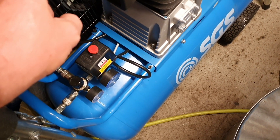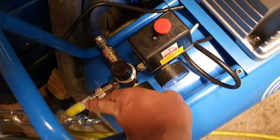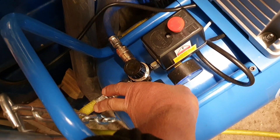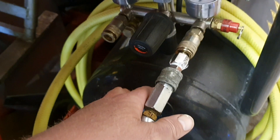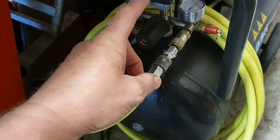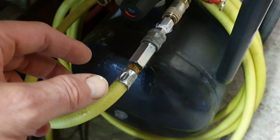I've got a 50-foot pipe going out. Now this is a two-outlet compressor, so this one I'm using as an outlet and this one as well. But that one isn't going to any power tools or spray guns — it actually goes along under my spray table to another compressor. What it does is it goes into this compressor. This compressor stays off, the other compressor comes on, and it fills this compressor. So it's filling both of them up, effectively increasing the size of your tank. This is a 50-litre and the other one's a 90-litre, so it becomes a 140-litre tank.